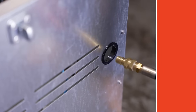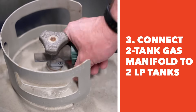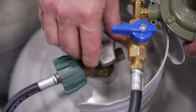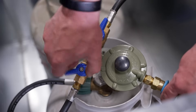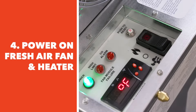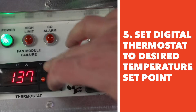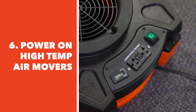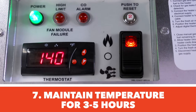Connect the supplied two-tank gas manifold to two LP tanks and connect the other end to the heater's gas hose. Slowly turn the cylinder valves to open them, then open the quarter-turn shutoff valves on the manifold assembly. Power on the fresh air fan and heater, and set the digital thermostat to the desired temperature set point. Then power on the high temperature air movers.